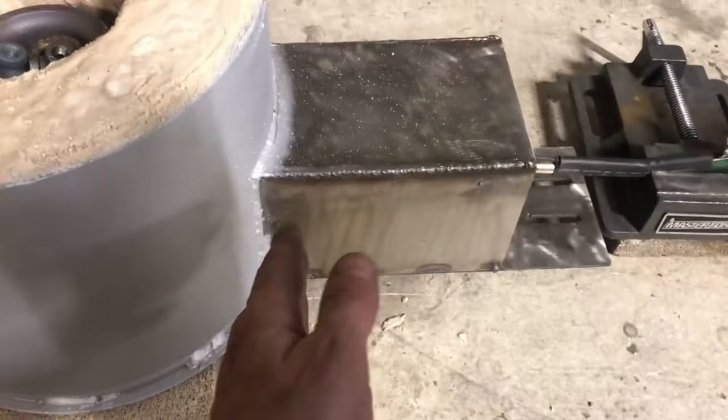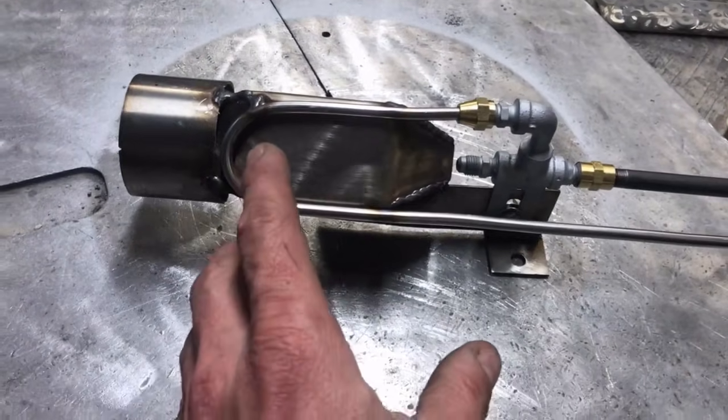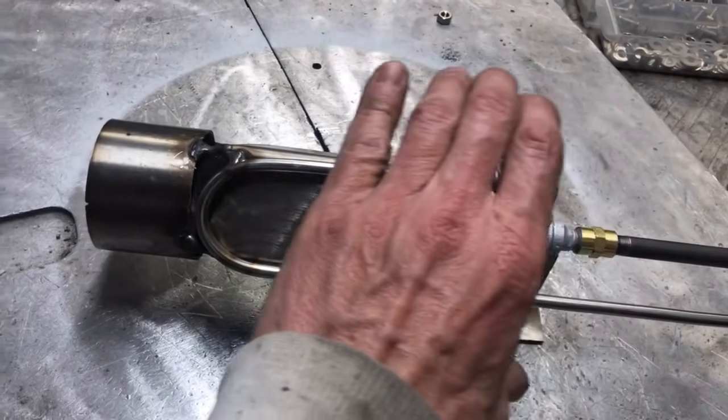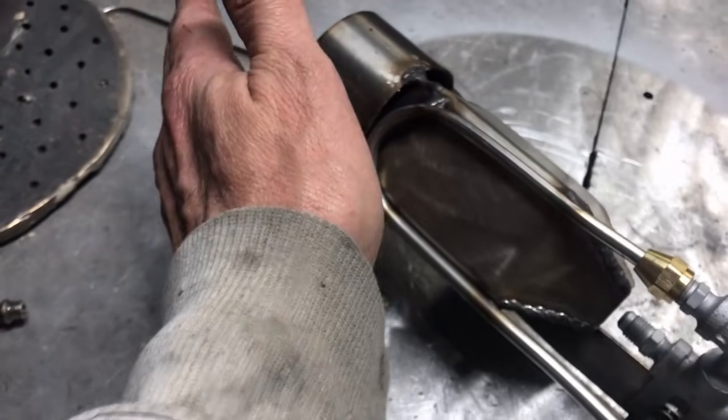This video is for Jeremy and his team who are going to be doing some cast iron smelting. Let's check out this foundry that I built to exhibit the features of the burners. You're wondering why I have this box sticking off the side of my foundry — that is because this combustion chamber runs at red hot temperatures, so it will in effect act as an air preheater. As incoming air passes over it, it will recapture that energy and send it right back into the foundry.